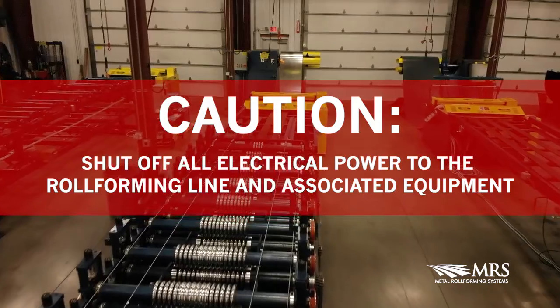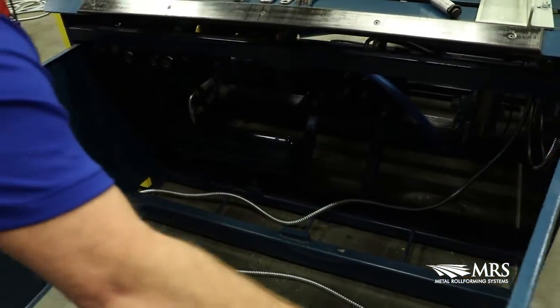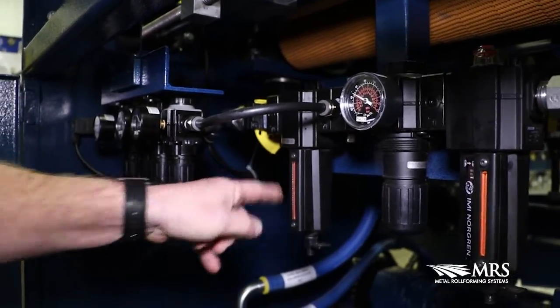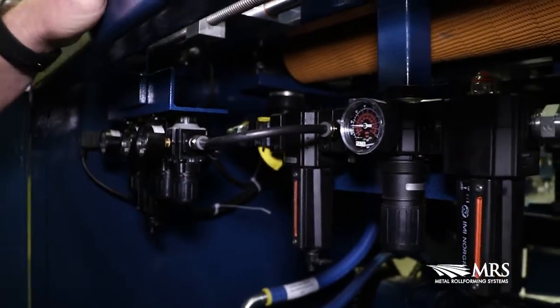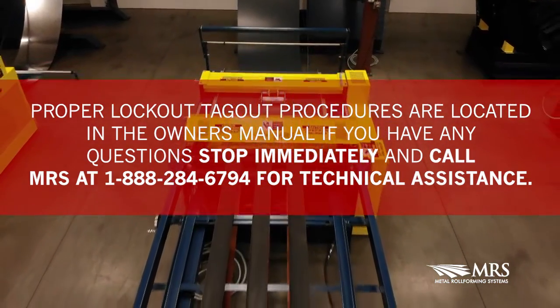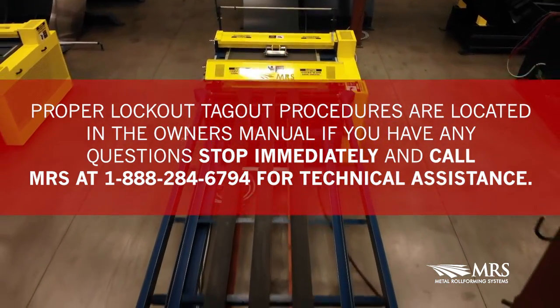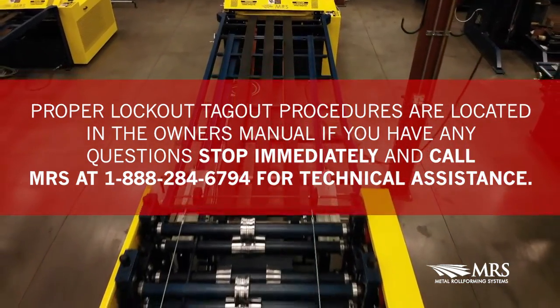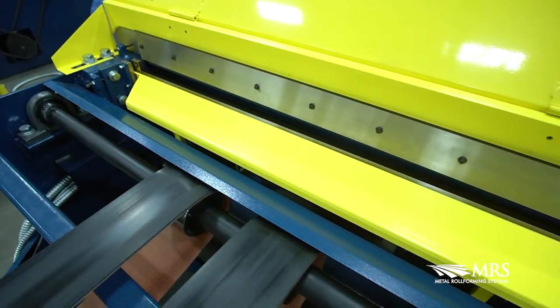and associated equipment. Then shut off all air to the shear and drain the tank of all air pressure using the drain valve. This is important for safety. Proper lockout tagout procedures are located in the owner's manual. If you have any questions, stop immediately and call MRS at 1-888-284-6794 for technical assistance. First, we'll move the top blade.